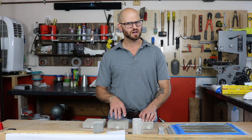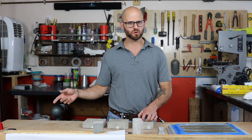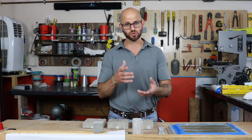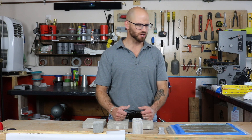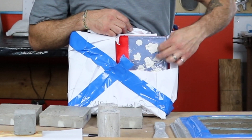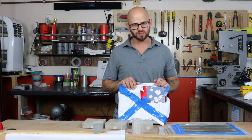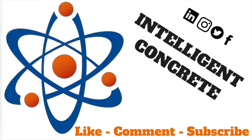I think it was 80 grams of color for the 22.94 pounds we used for the stepping stone mix, and it held that color beautifully. We'll show you the stepping stone mix here — it goes up tomorrow. Just a really beautiful color, absolutely beautiful. Look at that blue — that is just stunning. That's Quikrete for you. I really like that mix; I think I might use it in future projects. We'll try it out.